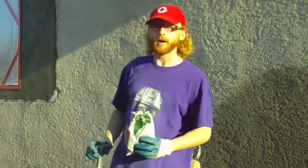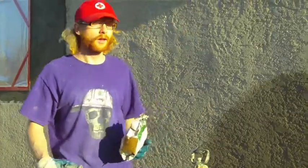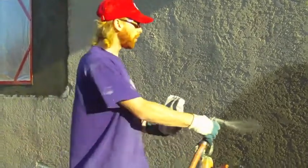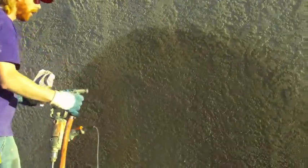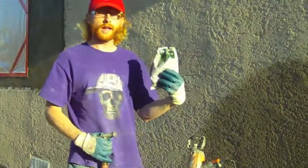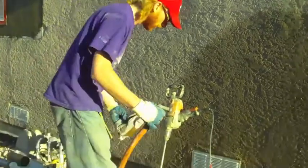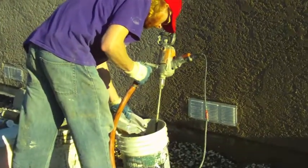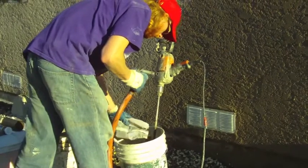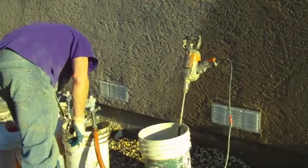While we wait for our base coat to cure before we put the molds on, I'm gonna mix the color. What you have to do is get your wall nice and wet first because our mix is full of water. I have my bag of color — this is clay — and I'm gonna slowly add this to our color coat mix until I get the right color. This takes quite a bit of time to get right, with lots of little mixes.